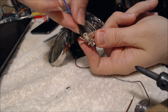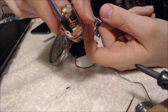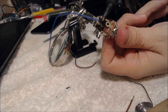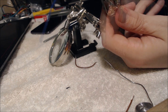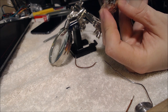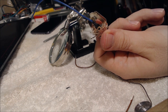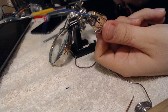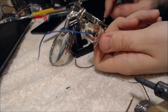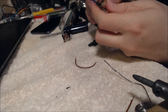You push it down and slide it over that little joint, and then you can see that there, hopefully. And it's as simple as getting your soldering iron and just rubbing it across this heat shrink tubing. Then it should shrink around that little peg and cover up all those little metal bits sticking out of the wire, so there'll be no chance that you'll short this thing by wires rubbing on it. So yeah, we're just going to use the same technique and put it together based on the instructions as shown in those wiring diagrams.